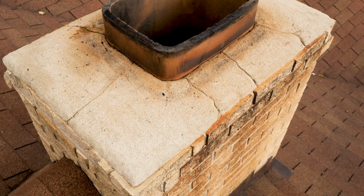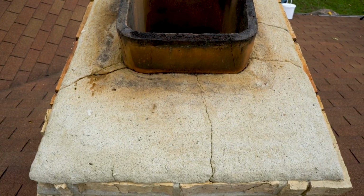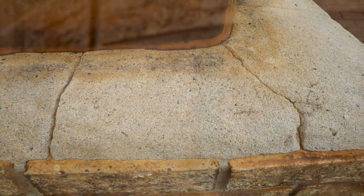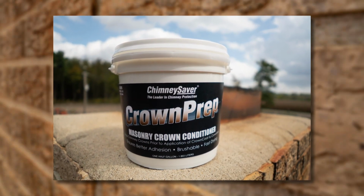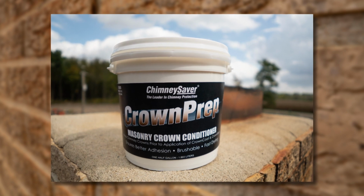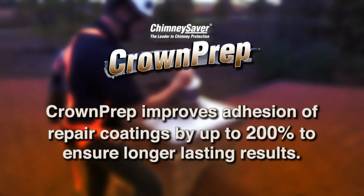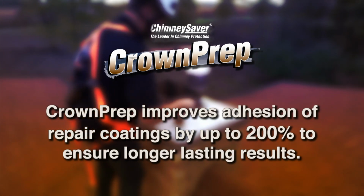Masonry chimney crowns are commonly made with mortar instead of the recommended concrete, which makes the surfaces sandy and porous. ChimneySaver CrownPrep is a water-based polymer conditioner that consolidates the surface prior to application of crown repair products like CrownSeal and CrownCoat. In ASTM testing, CrownPrep improves adhesion of repair coatings by up to 200% to ensure longer-lasting results.